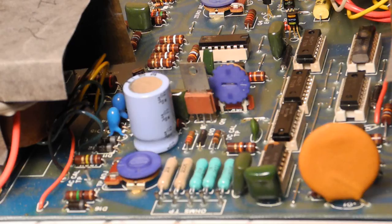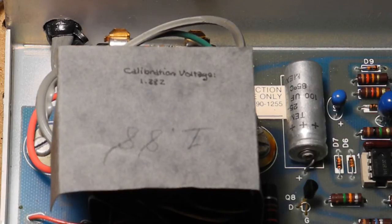Note that this is a different technology from the vacuum fluorescent displays from the same era which used a heated cathode. Calibrating a DMM is a chicken and egg situation — you need an accurate meter to calibrate it, but if you bought a DMM, you probably don't have one. Heathkit solved this by using a Zener diode reference for calibration. The Zener diode varies slightly with each diode, so they measured the Zener voltage and two resistors at the factory and recorded the unique voltage value on an envelope in the kit. The calibration voltage should be marked by the user on the paper glued to the transformer. Calibration can then be done using the known calibration reference voltage as well as a set of precision resistors.